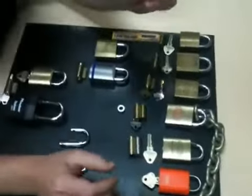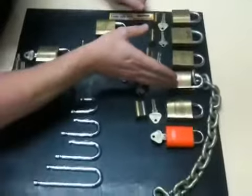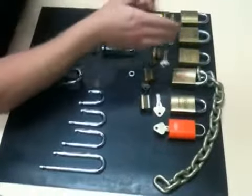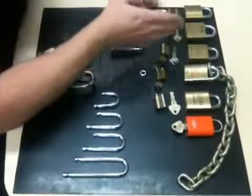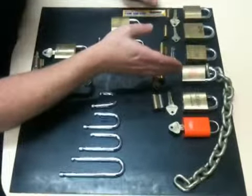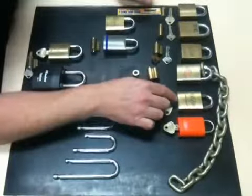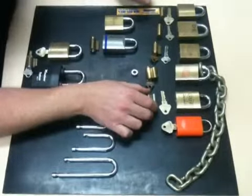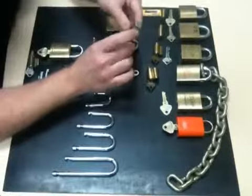Just moving on to some other brands — but before we do, everything from the 234-B45 backwards is now redundant and end of life. The manufacturer no longer produces parts for those models and we wouldn't recommend using them in a newer keying system. However, if there are a large number of padlocks in an installation that are the 334-B45 style, they could be reused because they are a modern padlock with available parts and fairly standard plugs.